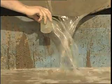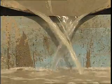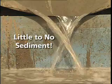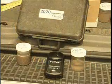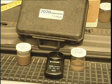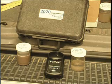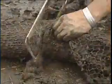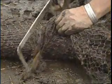We take samples from water entering the collection tank until all water flow ceases. Compared to the sediment-laden water that emerged from the upper tank, there is little to no sediment visible. We monitor the water for sediment concentrations and turbidity, then send samples to two labs for data accuracy. We then dissect a tube with a saw to see what's occurred inside — sediment has been captured within the entire three-dimensional matrix as the water filtered through.